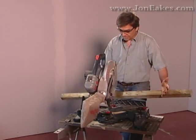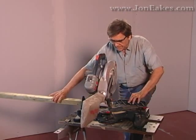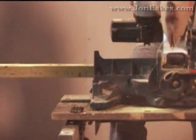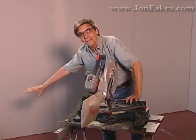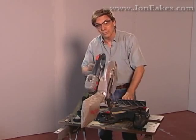That's fine when your piece of wood is about the size of the bed of the saw. But we usually cut things that are a bit longer, like this. We do need supports out here, not only for safety but for accuracy. Let me show you a couple of ways to do that.